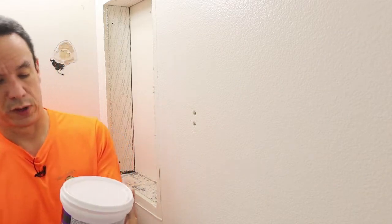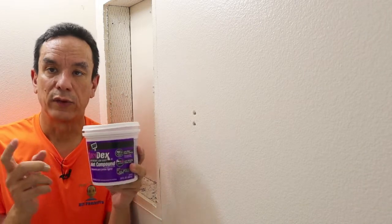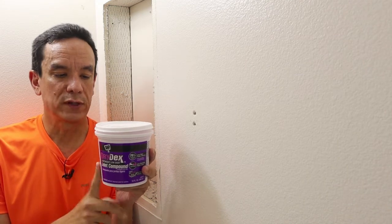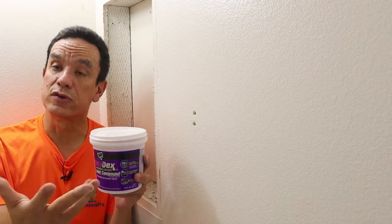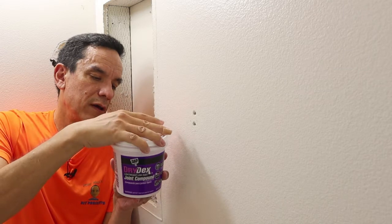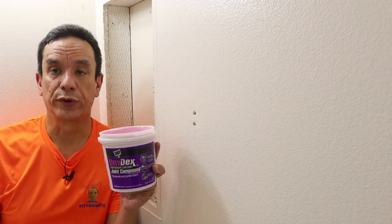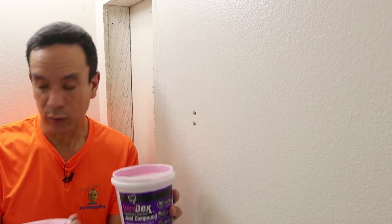Okay, today I'm going to be using a new joint compound that I've never used before by Dry Dex. This is not a sponsored video by any means, and the reason I'm showing you this is, although I've never used this, I use their wood filler. What they do on theirs is it's a certain color when you place it on, and then as it dries it turns into a different color, and that's how you know that it's dry. So according to what I found on this one here, it works just like the wood fillers. I believe it starts off pink, and when it fully dries it will turn white, and then you know that you can start sanding and then painting over it. So here we go.